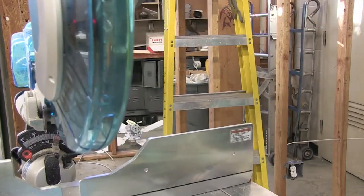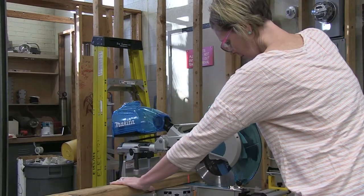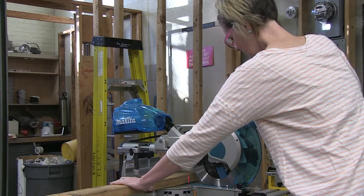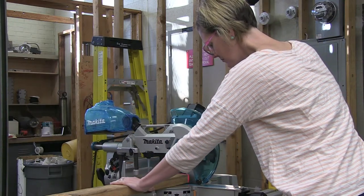When you are getting ready to cut with the sliding compound miter saw, the blade must not be in contact with your material until the blade is up to speed. Bring the head down to where you want to make your cut, keep the head away from your material, start to push the button, squeeze the trigger, and then lower the head into the material after the blade has come up to speed.